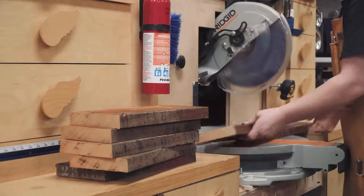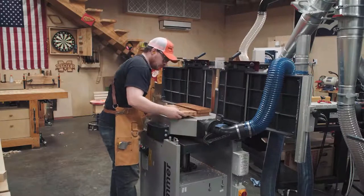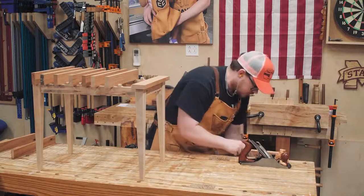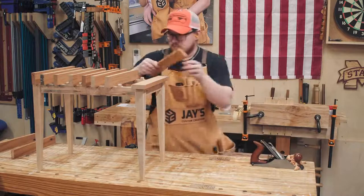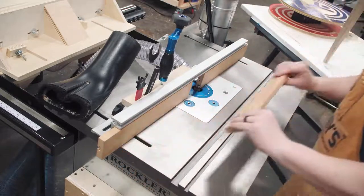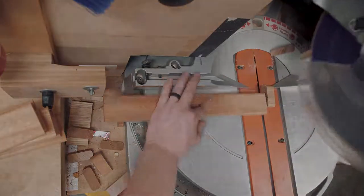I'm not 100% sure this wood is mahogany. While building I thought it was sapele due to the prominent streaks in the grain, but after analyzing the completed project next to a coffee table where I know the wood was African mahogany, I honestly just don't know. At the table saw I sized the pieces slightly wider than the slat cuts on the frame so that the narrow faces could be cleaned up and a perfect fit established with the smoothing plane. Back at the router table I cut the one-quarter-inch round-over on all long edges, followed by cutting the slats to final length at the miter saw. I got those two steps backwards — I should have cut to length first and then routed the edges, so the router bit would clean up tear-out caused by the dull miter saw blade.